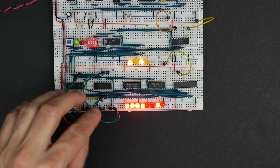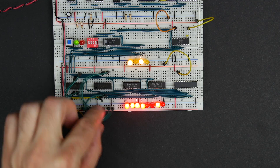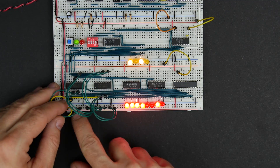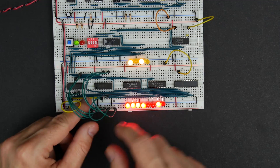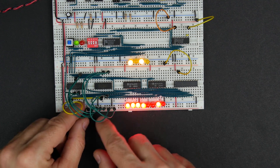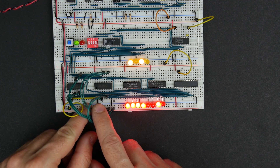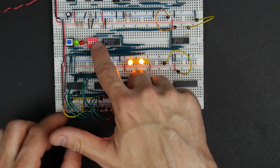In this video, what I want to do is something similar for the actual data that we're storing in memory. Right now we have these 8 bits, which are all set to 1s. But instead, we want to connect these to some sort of input that's either going to take the data to store off the bus, or take it from DIP switches — very similar to this.